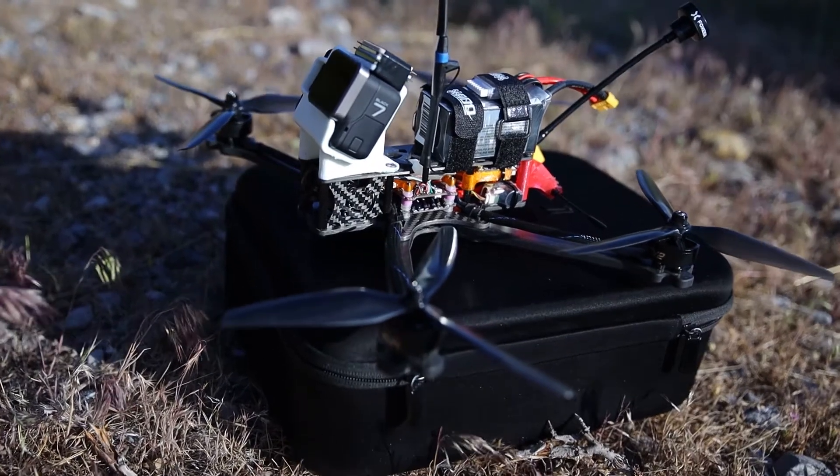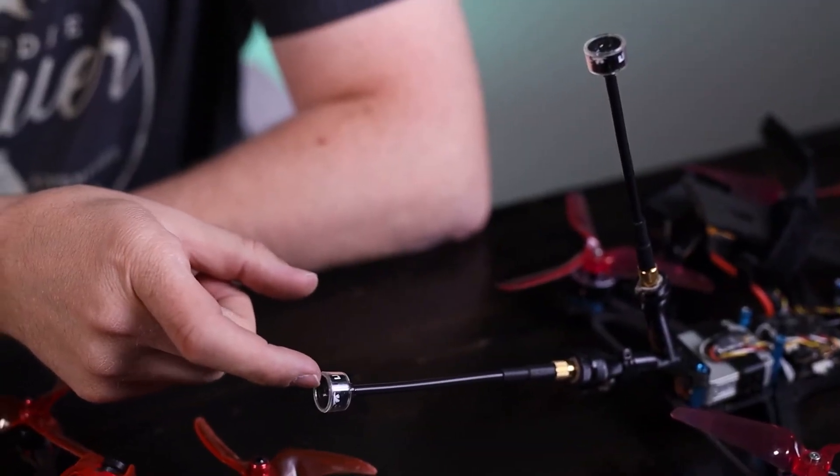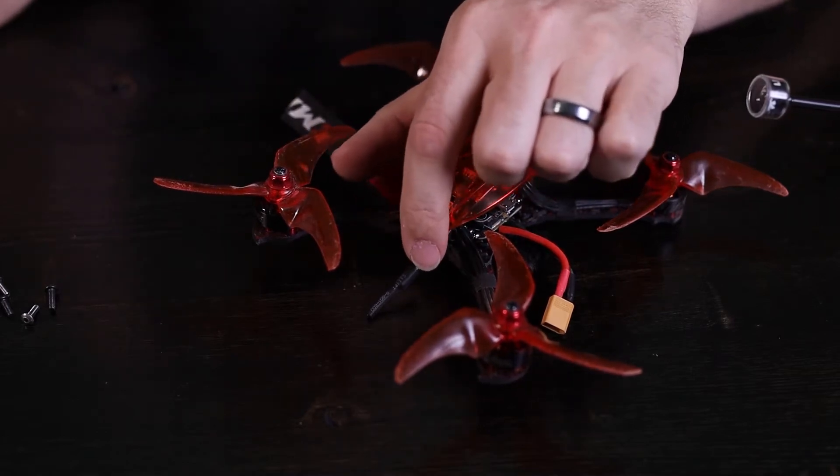A diversity Rx has two antennas and receivers built into one unit. This is a feature for redundancy, in that if one receiver loses signal, the other can take over. On top of this, some Rx's have connectors for different antenna options to help increase range.